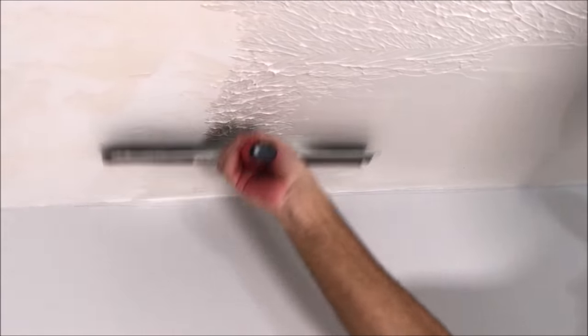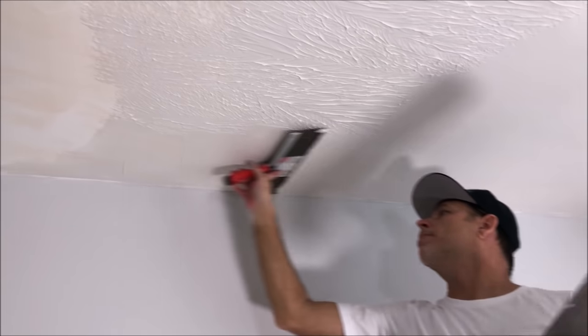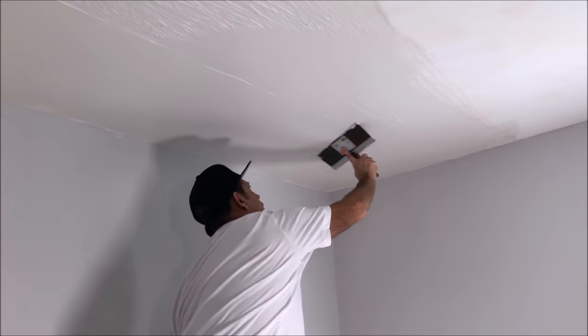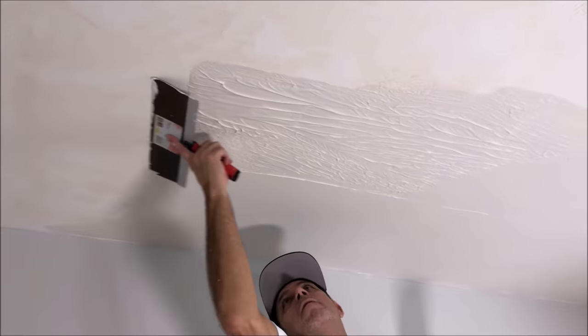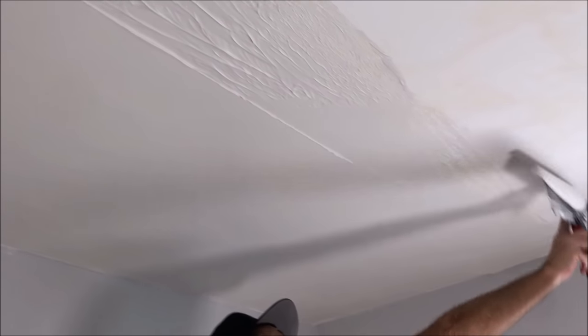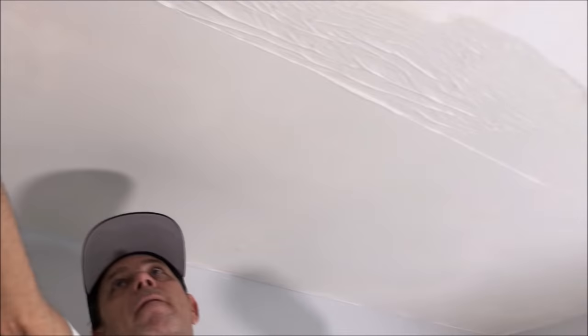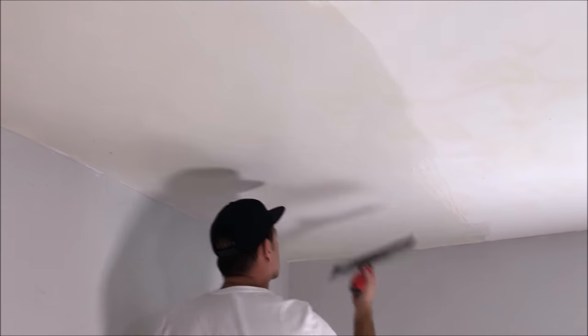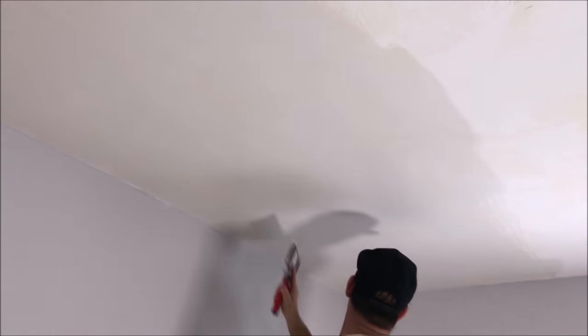I'm just doing the corners, making sure not to go down on the walls, and then I just wipe it back down. You're going to end up with a half a pan full of joint compound after all the wiping down. What I'm doing is applying pressure to the right side and no pressure on the left side — that makes the lines go away. That's how you get a nice slick finish: you don't have any lines to begin with, or very minimal ones where you can just scrape them down.